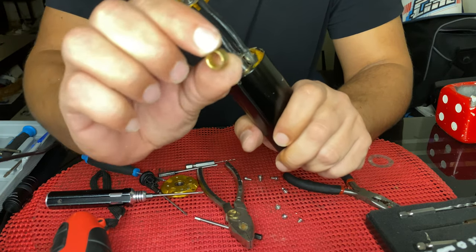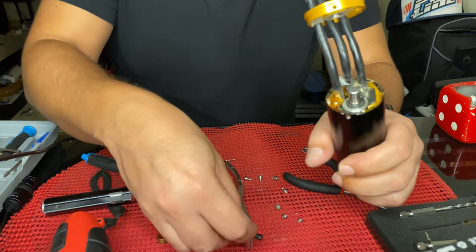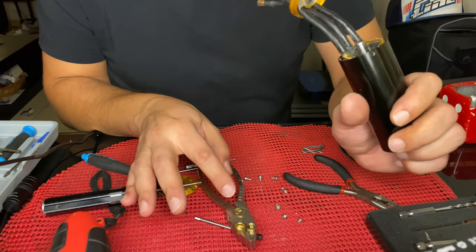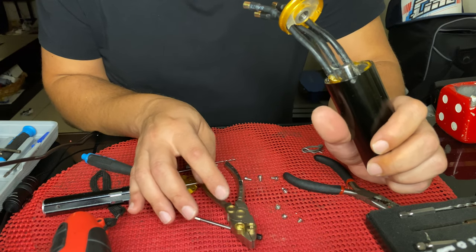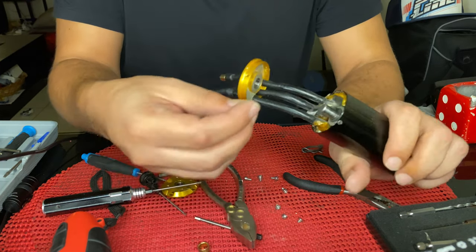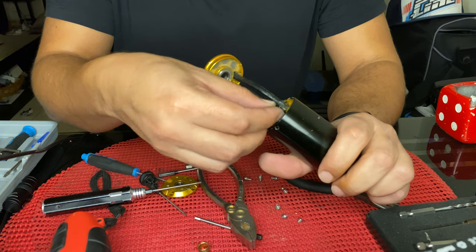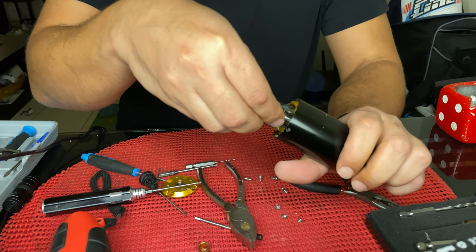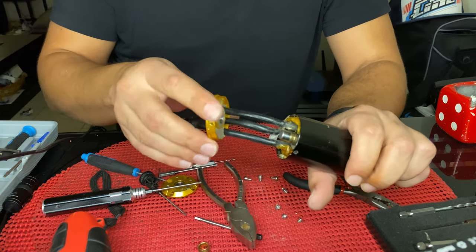The front spacer is bigger — I'll show you again. These two spacers are actually different sizes. In fact, you have three sizes of spacers in the TB Power motor. These two here are the smallest size. The bigger spacer goes at the back of your motor where the wires come out. Assembly order: first the washer, second the big spacer, then these two small ones. From this side the TB Power motor is sitting nice and easy.